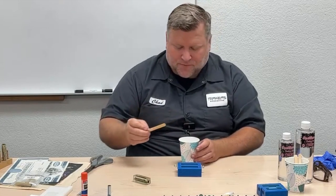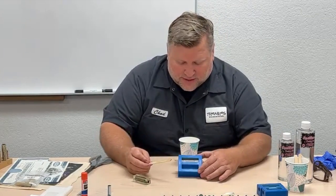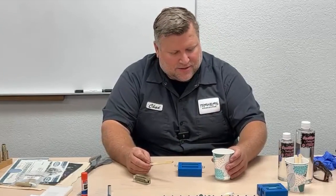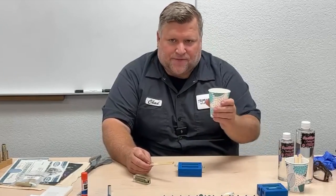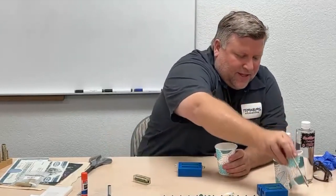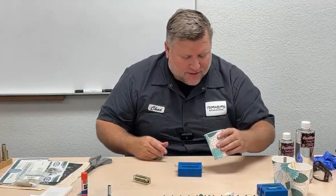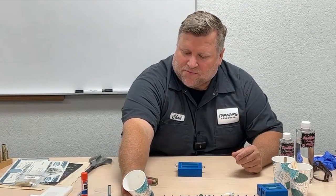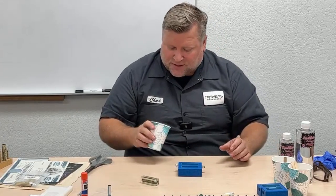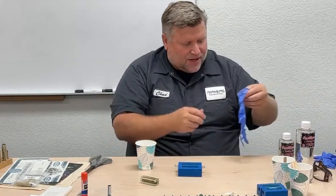Spilled some resin. All right, so I'm ready to pour this. I've got my resin here. I'm gonna kind of give it a tap, let it jiggle out. And I can actually feel, I don't have my temp gun because I really wasn't concerned about temperature, but I can kind of feel that the resin has warmed just in that amount of time that I held it. One other thing, there's a bunch of bubbles, and that's what's risen since I stopped stirring and since I tapped it. So I can kind of pour around it to where I don't pour that clump of bubbles right into my thing here.